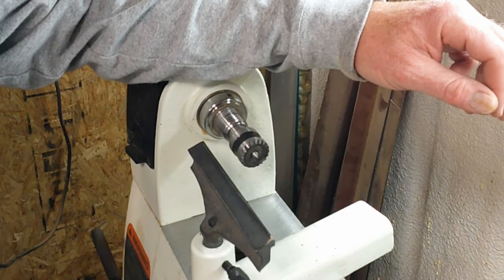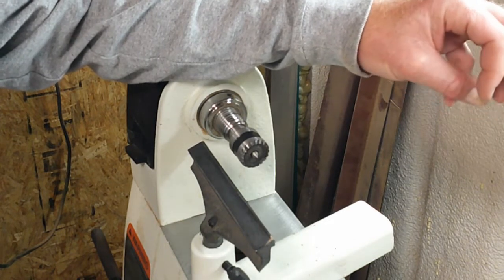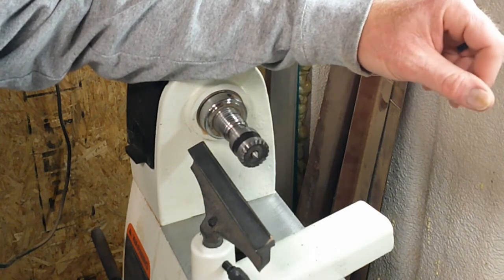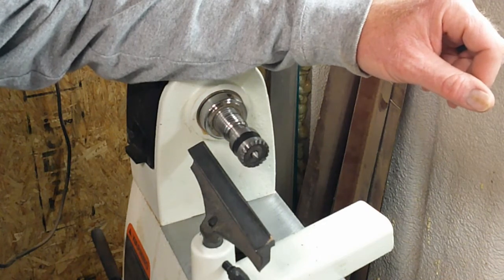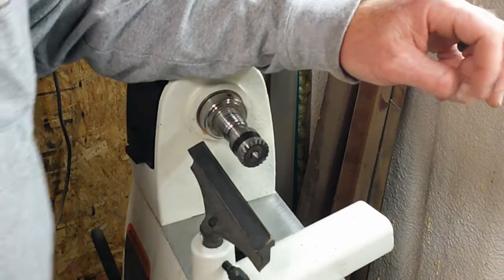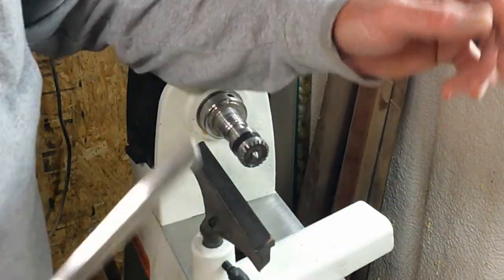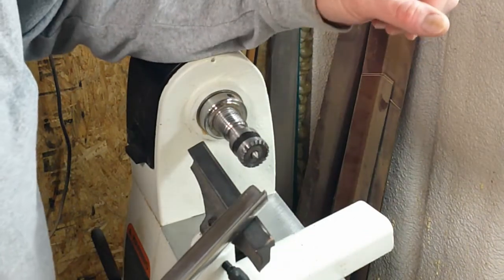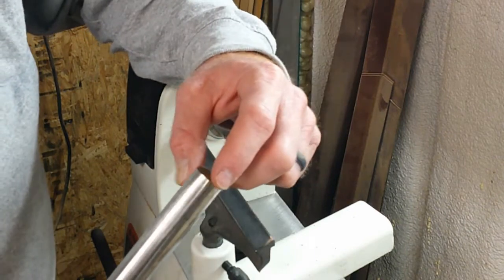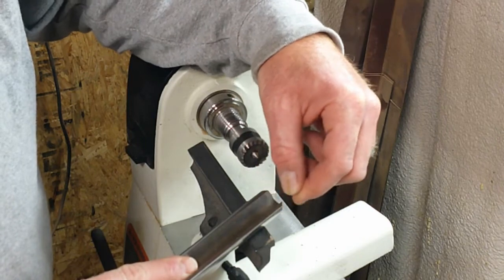Over the next five weeks, tonight I want to do some basic cuts. I want to hopefully produce a honey dipper by the end of the video. We're going to practice some of our basic cuts — the anchor bevel cut. What that is: we're going to anchor our tool to the tool rest, engage the bevel, and then bring the edge into the cut.